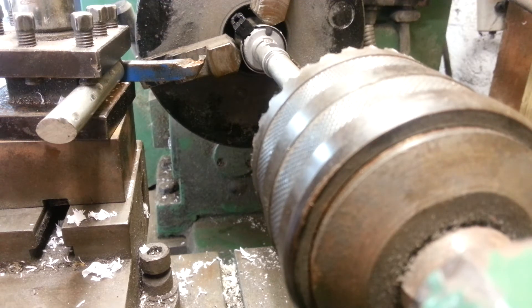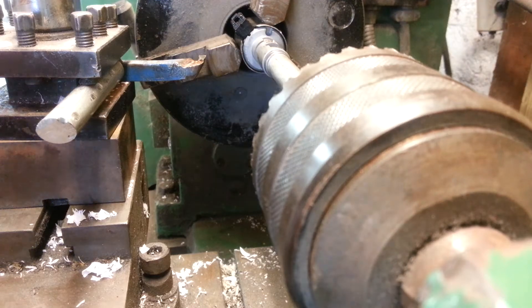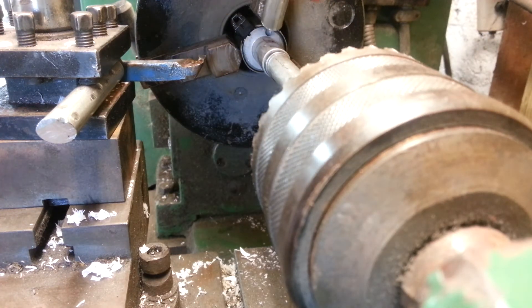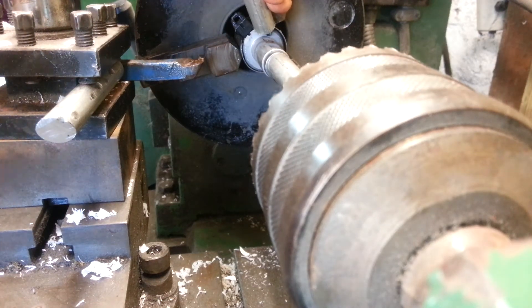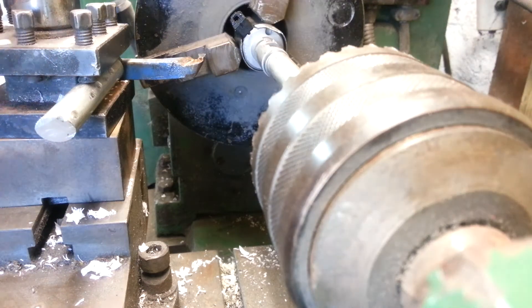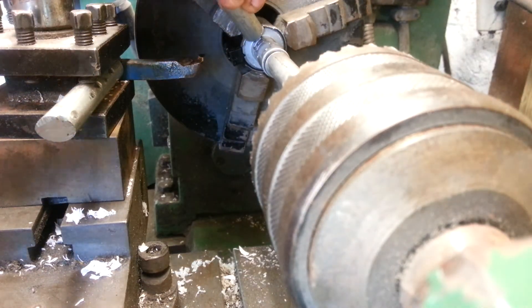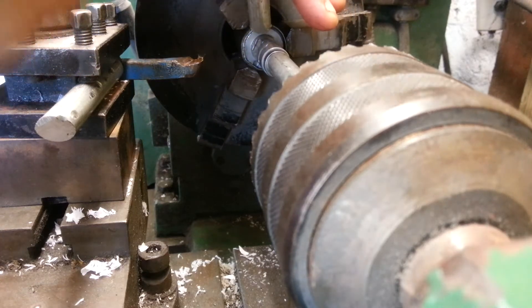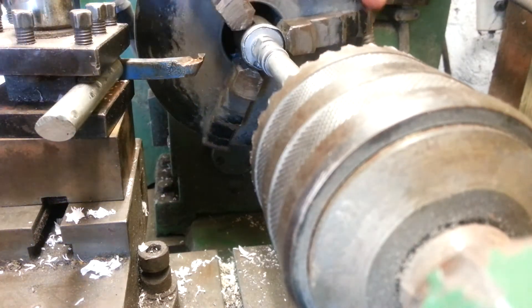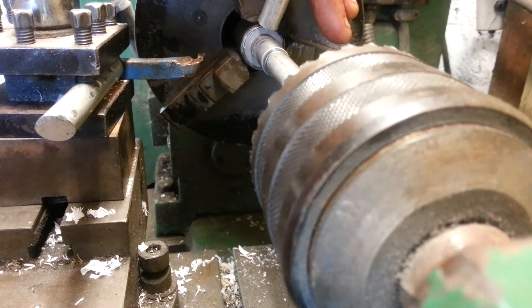Now all we have to do is close the case. The easiest way — I tried rotating it with a piece of aluminium and it works but it leaves swarf — the easiest way is just to peen it with an aluminium bar. I start right there on the corner where the plastic connector is and just peen it in. You can rotate the lathe; the aluminium doesn't hurt anything. Just peen it all the way round. Be careful not to hit the plastic connector, obviously.